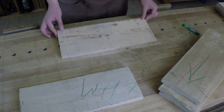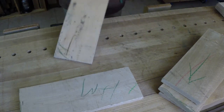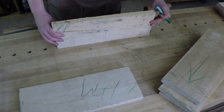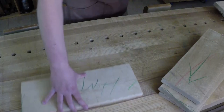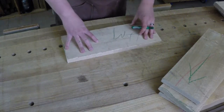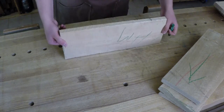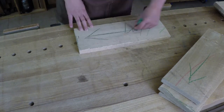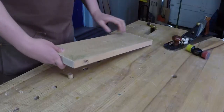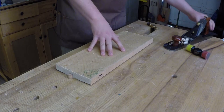I'm back to my hybrid milling technique here. With these pieces cut down to only 18 inches they register pretty firmly on a flat surface like my bench top, so I'll mark the high corners by producing a slight rocking motion and then plane them away. If the second piece is already registering flat on the bench I'll skip planing completely and just mark the grain direction. Remember: when running through a thickness planer you need to feed the board the opposite direction you would run a hand plane, because now the board is moving and the cutting stays still.